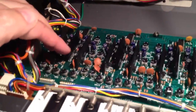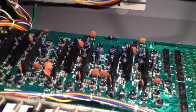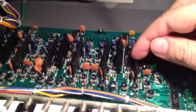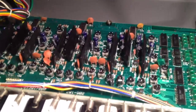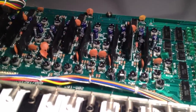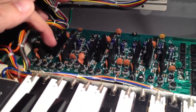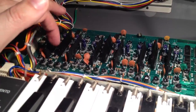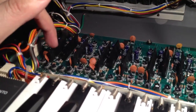These are the culprits. There's plenty of documentation online and plenty of videos of people who take these out, soak them in acetone to get the coating off, at which point the chips wake up and work perfectly. There are a few theories as to what this is. Some say the coating has become conductive, which I find a little hard to believe — it would cause a lot more problems than what we're seeing. The other theory is that it's introducing capacitance — again, I don't really buy that. The most likely explanation to my mind is that this coating, as it's degraded, has become hygroscopic — it actually attracts moisture. If the chip loses its seal, it basically captures moisture and keeps it around the innards, which is why getting it into acetone and stripping that off cures the problem.